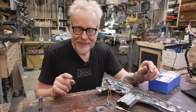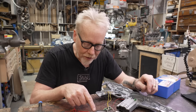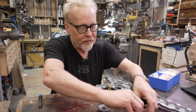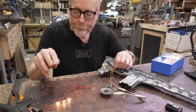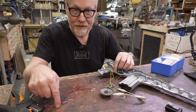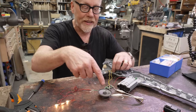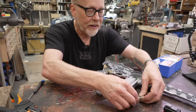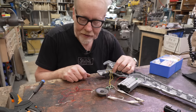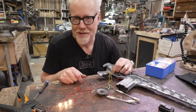Side note: the designers of these electronics were using the voltage drop from the speaker going at full volume to operate the lights. Watch this — the lights are on when the speaker fires. They're going in line with the speaker. That's not because a program has been written for these lights that matches the speaker. I believe it means the voltage for the lights is semi-attached to the voltage drop across the speaker. Because when I connect the resistor in line and it gets quieter, the lights don't blink as much. That's just circuit design. I wouldn't worry about it — just a side effect I noticed.